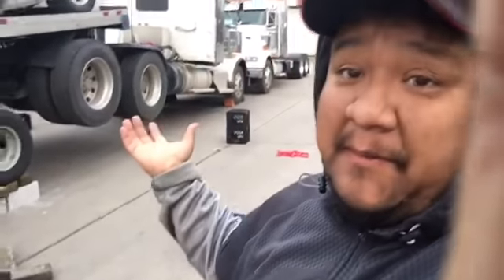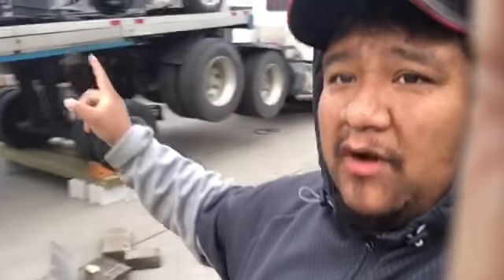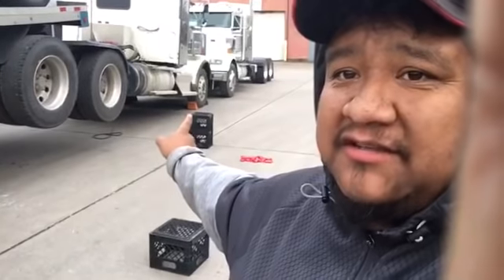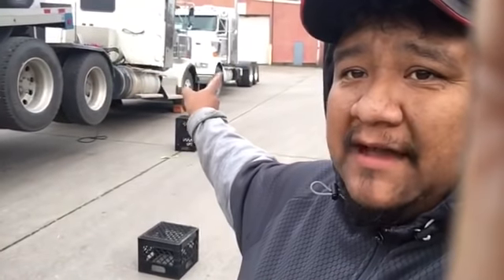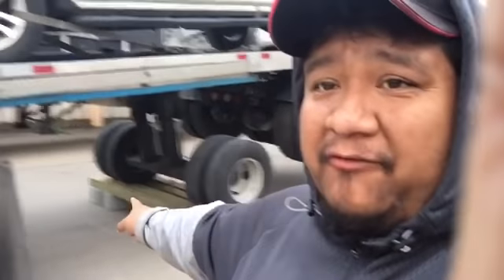The truck I'm driving way back there is bumper to bumper with this truck. Since everything is so high, when we back this fifth wheel into that kingpin, we don't want that truck to jump those chocks. By bumper-to-bumper with that other truck, there's going to be no damage and this whole setup ain't going nowhere. Now that we got it up on the higher platform, as you can see we're clear — time to get it in the fifth wheel!